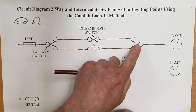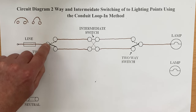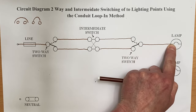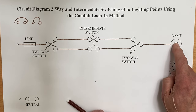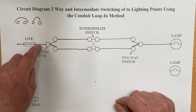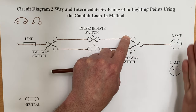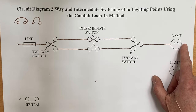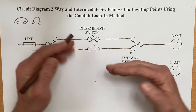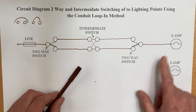Let's work out if this lamp would have a switching line. The line comes through the overcurrent protection device into common, and comes down the blade of the switch. If the blade is in a position where it connects through, the lamp would have a switching line — we'd obviously need a neutral on the other side to illuminate it. If we change the blade position, the circuit is not closed and the lamp won't illuminate. The intermediate switch works across the diagonal — it shorts both across diagonally so it's either open or shorted across, and that probably needs a separate video explaining it in more detail.